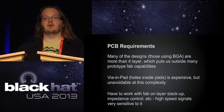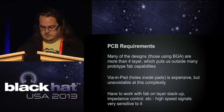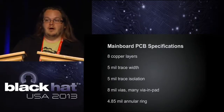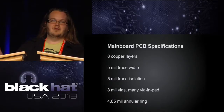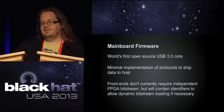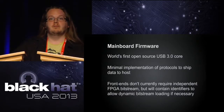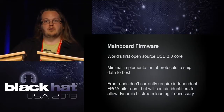For our main board designs with the BGA, needing more than four layers puts us outside of most prototype fabs — we couldn't use OSH Park or BatchPCB. We also had to do vias-in-pad, where holes through the circuit board go through the component pads, which roughly doubles the cost of prototype boards. We had to work with the fab on the layer stack-up — what layers went where, how thick each layer was — because it affects impedance, and high-speed signals would get corrupted otherwise. The main board firmware, mostly developed by Marshall, is believed to be the world's first open-source USB 3 core — all USB 3 handling done on the FPGA.